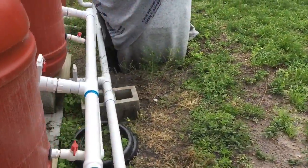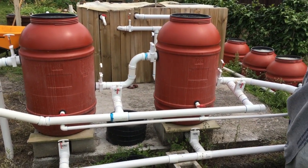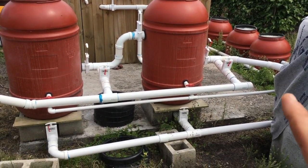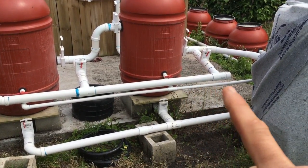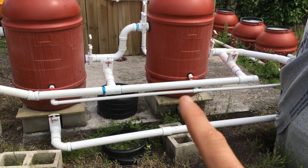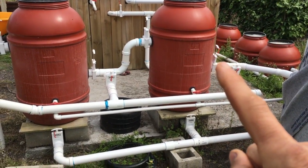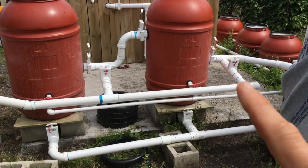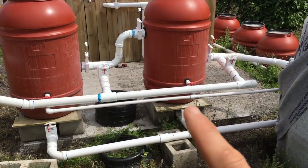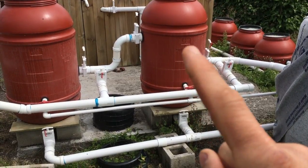Now, clean out. My clean out is very simple. I think I showed this in a prior video, but I'll go ahead and show it again. Nothing's changed. That's an air line from the 2 pumps at the pump house. Pump it, open it there. There's a manifold at the bottom. It boils the very top. But before I do that, I close the valves so that no more water enters. I open the bypass loop for the filter. Open that, and it goes in here, and that isolates this tank here, and that gets that guy cleaned out. I let it boil for maybe 10 minutes or so.